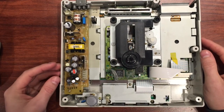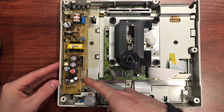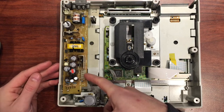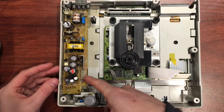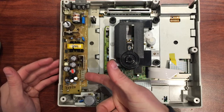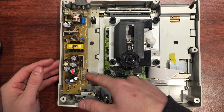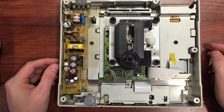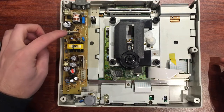This is an earlier revision of a Model 2. When you see the power supply with five pins, they're slightly earlier - this is very similar to a Model 1 power supply. The later ones actually only have four pins: two grounds and two five volts, the whole thing just regulates down to five volts. But on this slightly earlier model it's two grounds, a 3.3 volt, a 5 volt, and a 9 volt. So this power supply is doing a lot more work, and there's a linear regulator here and one up there as well.